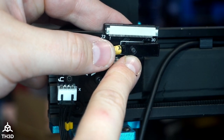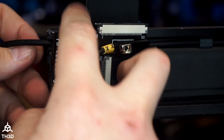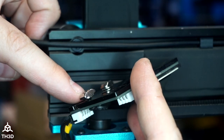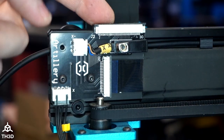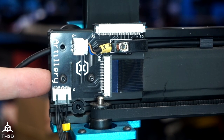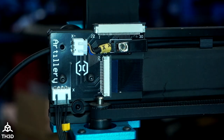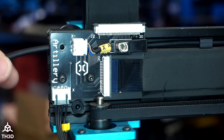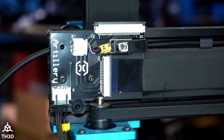If you want to use an M3 nut instead of a T-nut, you can, but the included T-nut works just fine. Go ahead and spin that on — it just needs to be finger tight. Go ahead and put the EZ-ABL cable behind the board and put the board back in place. If the board won't go back, make sure the T-nuts are rotated horizontally so they go into the extrusion channel. Tighten them up. With the two screws screwed back down and this one flipped around, you can see the cable passing through the rear. That's all the cable routing needed on the X-Gantry. If you disconnected your ribbon cable, go ahead and reconnect it — make sure the little tab is pushed up and press it back down.